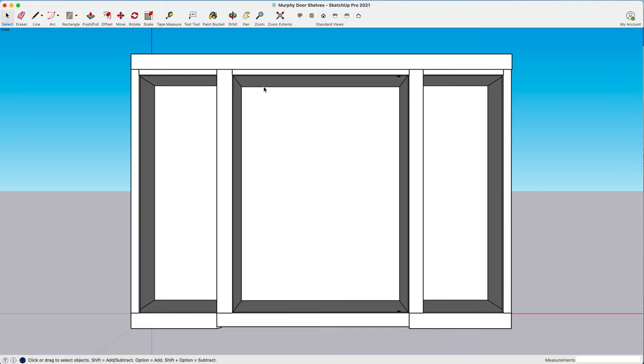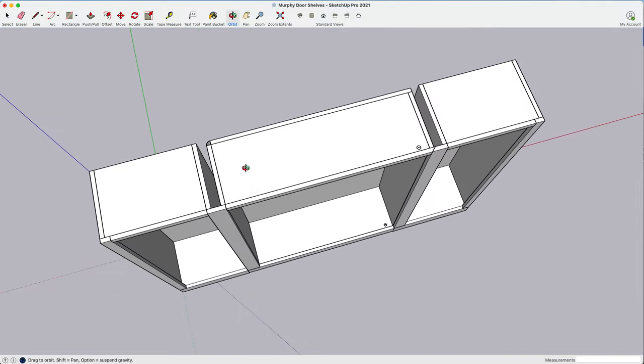I'm going to hide the top part now. Looking at it from the top you can see the bookcase right here — it's got a rounded corner over here. It needed to be rounded in order to pass by this point, because this point and the bottom point are the pivot points for turning the bookcase. You can see that the right fixed bookcase has got a mullion in the middle that covers the sides of the bookcases, and there are rails and stiles all the way around the front of the bookcase. You can see this angle cut right here — it's a square piece of wood.